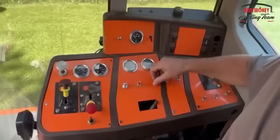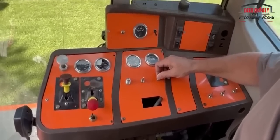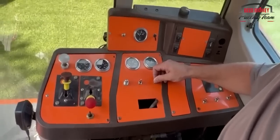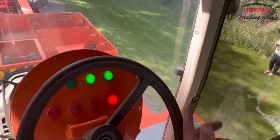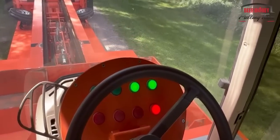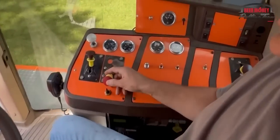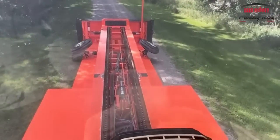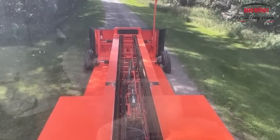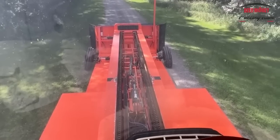We're going to also hit another switch to reset the pan and reset our push down, and then the green lights are going to come on. Then we're doing this all simultaneously as the box is coming back, correct? And we get the box all the way back under the cab, and you take your box drive out of gear, and you got your pan wheels. Put your pan wheels down, and with your wheels on the ground, you'll be able to steer.